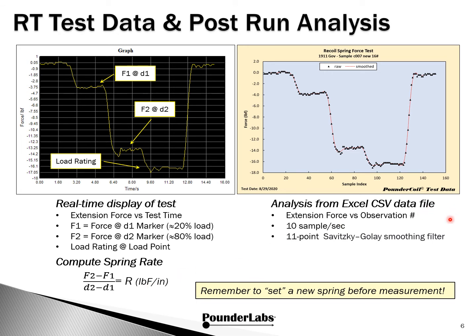The test run also stores data in an Excel CSV file for later analysis. We plot sample size — since this runs at 10 samples a second, you can see 14 seconds yields 140 points. We've also had the provision to put a smoothing filter on this to help pick different points, but we find that's generally not necessary. Eyeballing off the real-time chart generally does the job. It's important to remember when you get a new spring, and it's probably adjusted for set, you need to draw that spring down all the way to the solid height to take out the set before you measure the free length. Once that's been done, you don't have to do that again as you're making subsequent measurements.